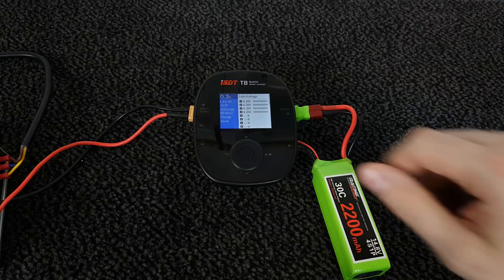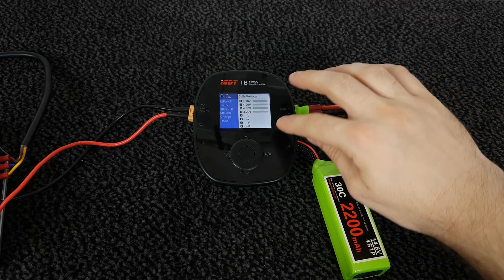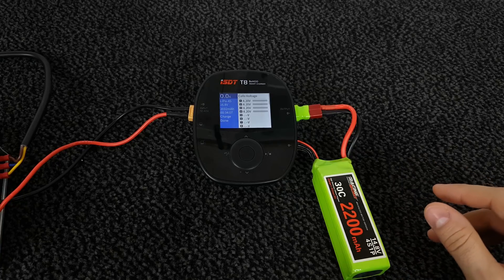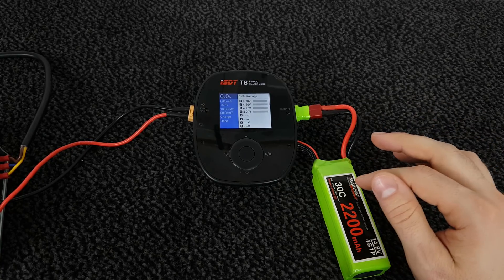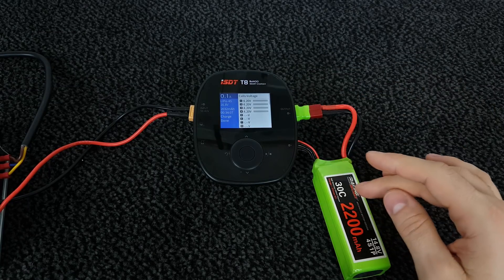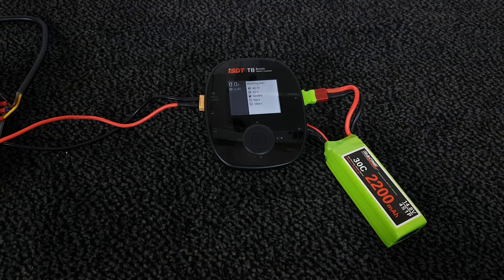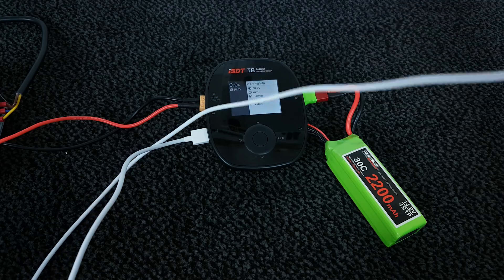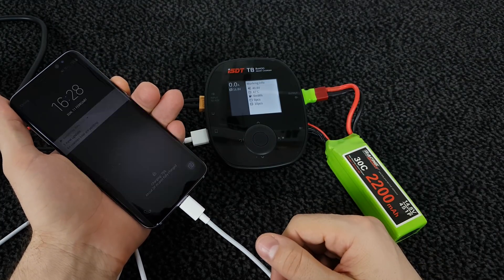After sitting here for 34 minutes monitoring the charging process, I noticed that the first screen was orange, which means fast charging was active. When the screen turns from orange to green it means the difference between each cell is less than 20 mV — at that point charging is pretty much complete and you can take the battery out if you're in a hurry. If you leave it longer for deep balancing, the screen goes from green to blue, which means the difference between cells is less than 10 mV. You can also charge your phone via the USB port at the same time as charging your batteries.